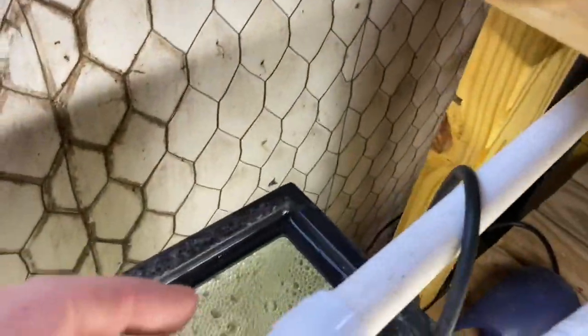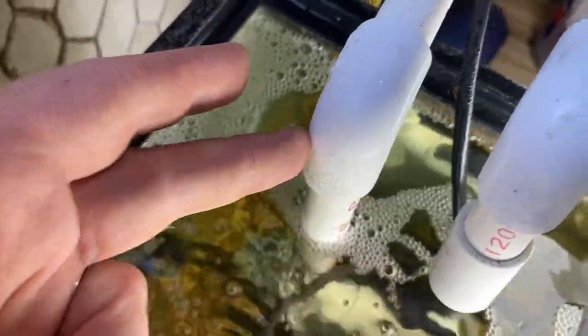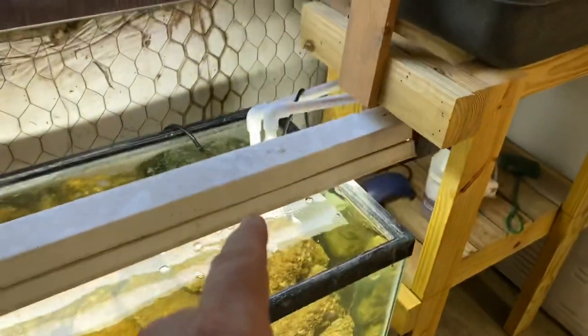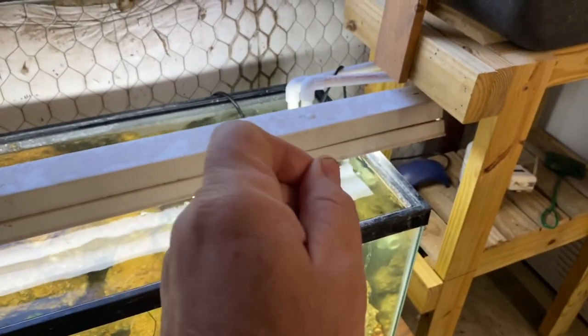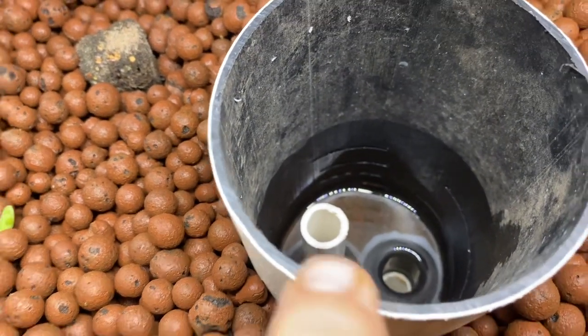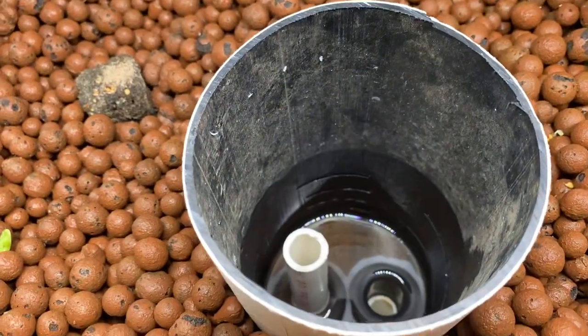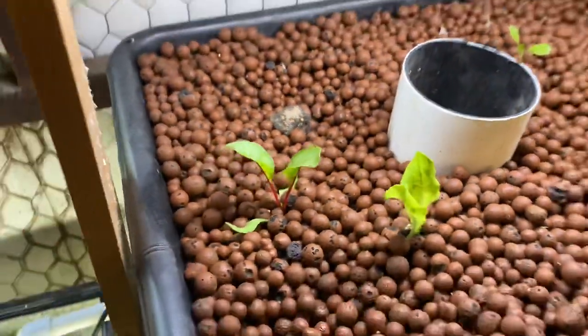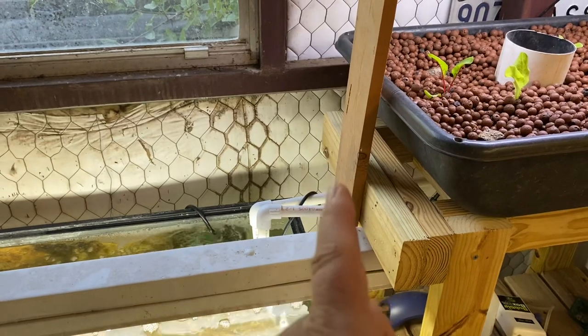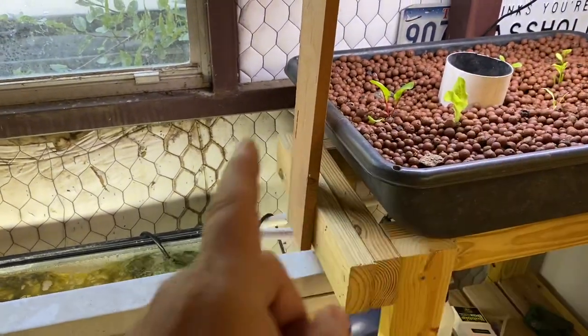Here's your delivery right here — it goes down to a little 400-gallon pump. That 400-gallon pump is vented, and there's a swing valve in there because I don't need anywhere near the full flow out of that pump going in there. That pump is made by Allied Aqua and has a throttle rate on it. I've backed it down a bit and also controlled flow by how open the swing valve is. This is important because I can push more water in through that bottom hole than this overflow can return — the delivery is under pressure, the return is under gravity. You have to control flow one way or another; you can also put a valve in your delivery line.